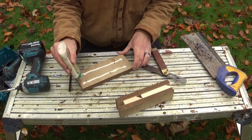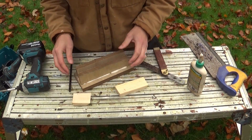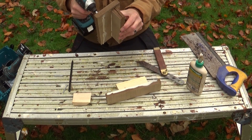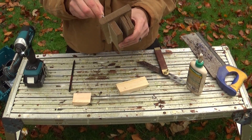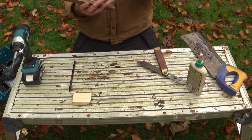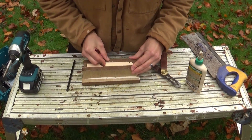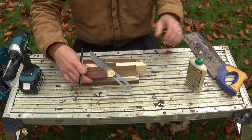So I made a miter box for this, which is the best way to cut miters if you don't have a chop saw — personally a chop saw is 100 times quicker, but here's how I made this disposable one. It's a one-off use — you cut it, you throw it, you make them from scrap. Take some wood the same thickness as what you're going to cut, sandwich it between some scrap, mark the positions on a base plate, pre-drill for some screws, add some glue, stick it down, and screw the two sides to the bottom plate. Once your glue's dried, mark a 45-degree angle — or whatever angle you need, could be 90, could be 33 — mark it there and you cut it.